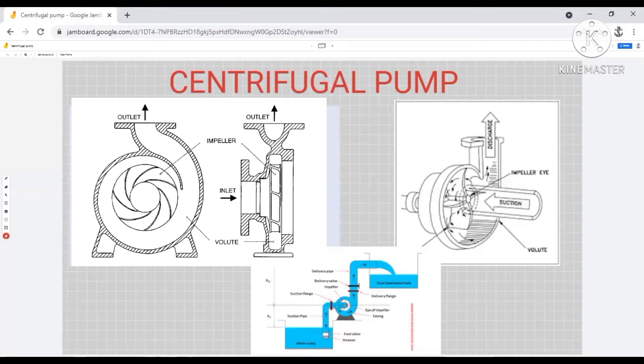Another problem arises in that the impeller will rotate at a high speed. When the impeller rotates at high speed, the adjacent water where it is imparting centrifugal force will also rotate at high speed, so the discharge will be at high speed. This means the velocity of the water will be more and the pressure head will be very much less, so the pump can be used for very low pressure head purposes. Also, since the velocity of water at discharge is high, frictional losses will be high because frictional losses are directly proportional to velocity.